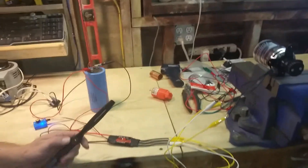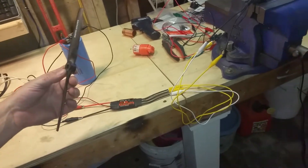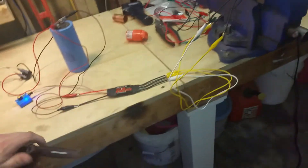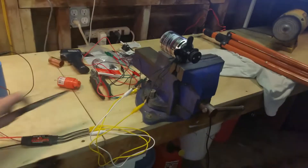I loaded it up with the prop — free running it draws about 1.6 amps. With this prop on here it draws about 2.2 amps, and then when I hand-held it, it went up to 3.5 starting off. It is a very torquey motor for sure.